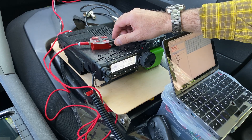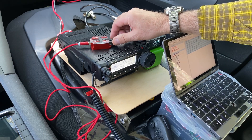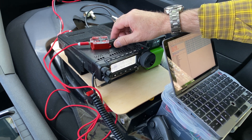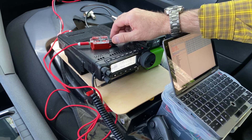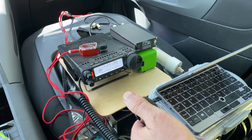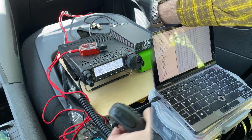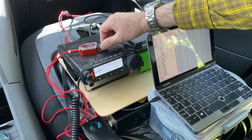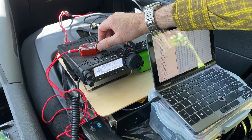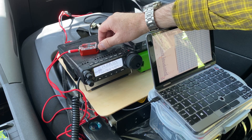10 minutes into the pile-up and SWR still stays. More than 50 European stations gave me good reports on 40-meter band, proving the tiny Unun core works fine on lower bands. But on higher bands the situation changed a bit, with some weird things happening. On 20-meter band: 1.2-to-1. After about 5 minutes of intense operation at 70 watts, the tuner started indicating high SWR and issued an alarm signal.